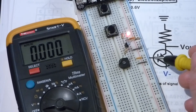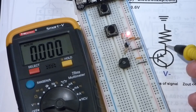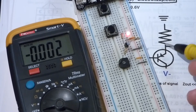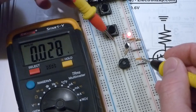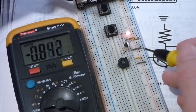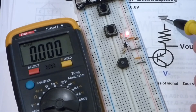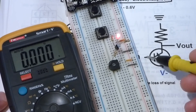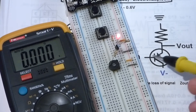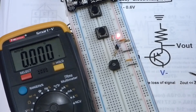As I said, we lose about negative 0.7 volts from base to emitter. So at the emitter we should have close to negative 2 volts - we had about negative 2.7 volts at the base, so up here we should have about negative 2 volts. Putting the probe at the emitter, you can see it's about negative 2 volts. So ultimately the transistor allows voltage to go from collector to emitter based on the voltage at the base, but you lose about 0.7 volts - in this case negative 0.7 volts. You get the base voltage minus about 0.7.